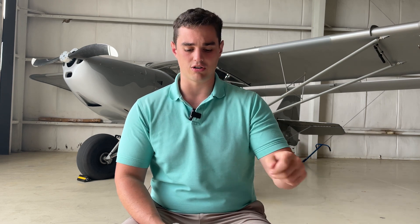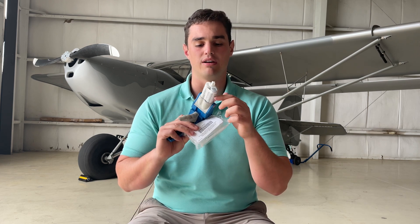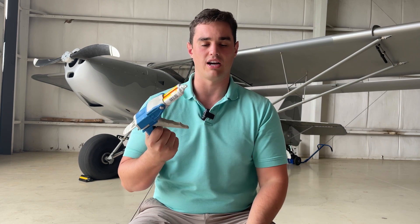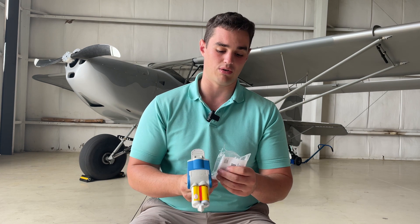The way I was originally mixing hysol was shoveling out an amount onto a scale, weighing it, then shoveling out another amount to get exactly the same weight, mixing it in a bag with only 30 minutes to an hour to use it. Kit Fox includes little syringes — I tried one once and it was such a pain. So I ended up using plastic bags and dispensing like an icing dispenser. Towards the end I bit the bullet and bought a hysol dispenser for 25 bucks, and I really couldn't do nice fillets without it.